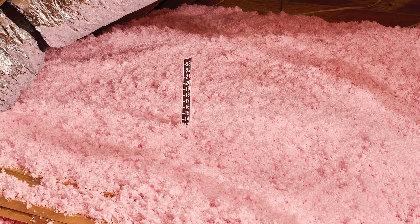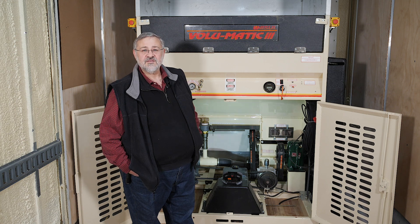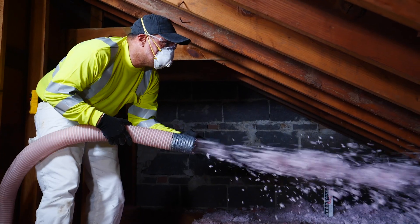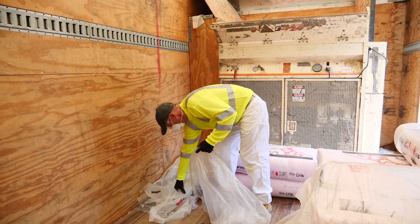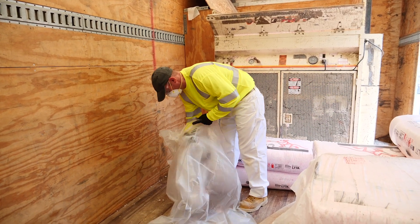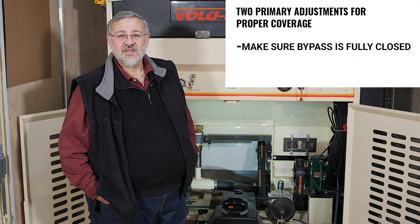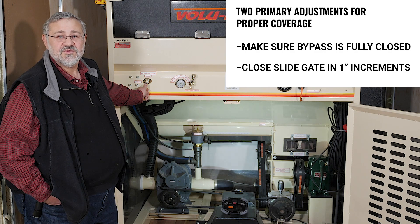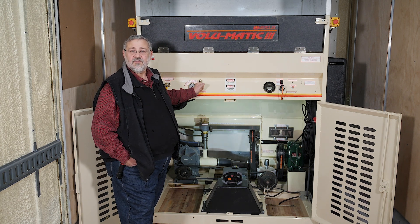Your goal in setting up the machine is to receive the desired R value at the labeled coverage, ensuring you are blowing the correct number of bags, thickness, and square foot weight. You can do this by calculating how much material is needed to blow a defined area at a desired R value. If you are using too many bags, you may have too much material for the amount of air. First, check that the air bypass is fully closed. Then adjust by closing the slide gate in one-inch increments. If coverage calculations show you are not installing the required bags, adjust in the opposite direction to increase the amount of material into the airflow.